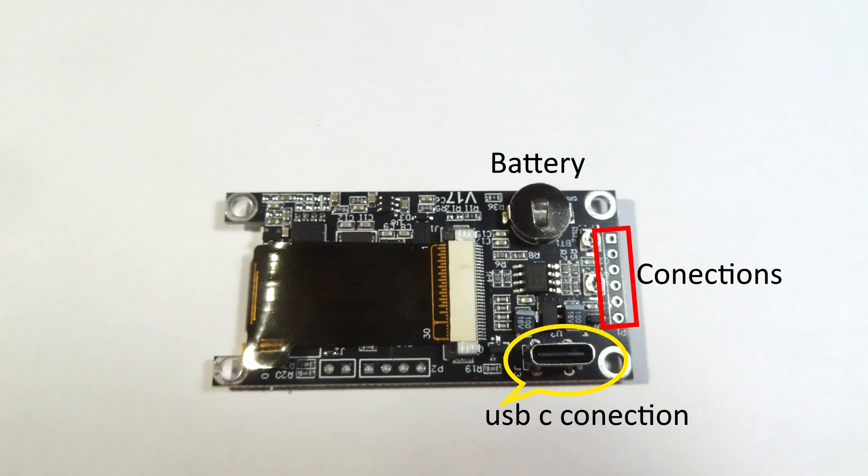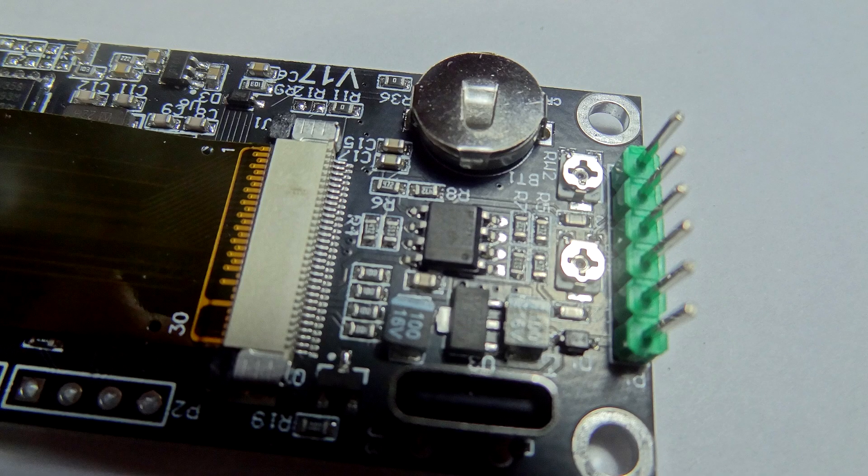The brightness — the switches at the front can be removed if you want. It's got a USB connection, and if I unplug it from the side, the plus five volts at the side can power it, but it also has a USB-C at the back. Looking at the back of the board, there's quite a few bits on there including a little battery. There are two little trim pots at the side — I haven't touched them, but I'd imagine those are factory-set level controls to match left and right channels. The board is 60mm by approximately 29mm, and the display is 46 by 25mm.